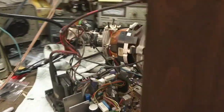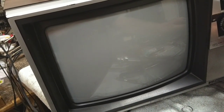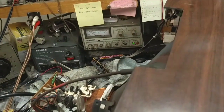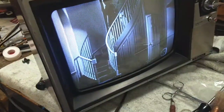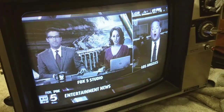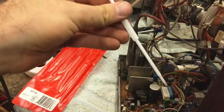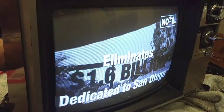Alright, so it's all assembled enough for where I can run it — I've got the chassis kind of splayed out so I can poke around. I've touched up the board and cleaned up all the brown glue. Let me move an antenna so that I actually get some form of reception — surprisingly enough, in mid-city you don't get much. Let's go to a colorized channel. Alright, so I've got no color going on here, well I've got rainbows. Let me grab an alignment tool and we'll tweak on that variable capacitor a little. This is your frequency variable, and it does change things.